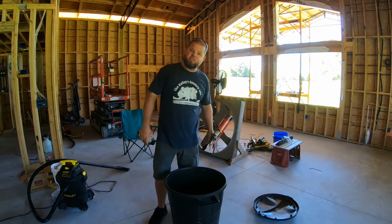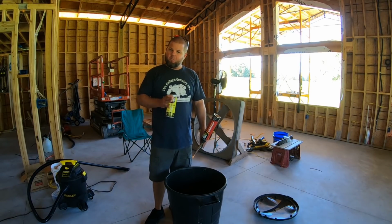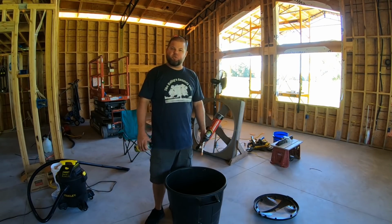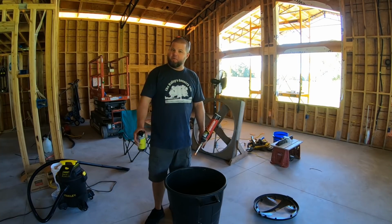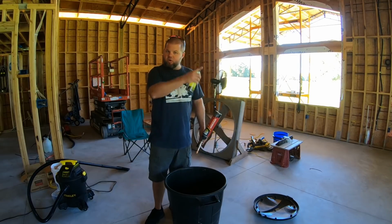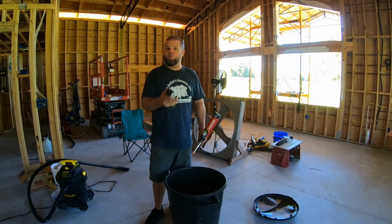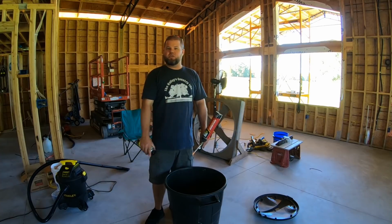All right, so this episode was supposed to have a lot more sealing in it than it did. But, like I said, I was pleasantly surprised to find out from the insulators that they're going to seal bottom plates and everything else that I was going to take the time to do. Not to mention, we're going to seal every crack around the wall, by every 6x6, every double, triple, or quadruple stack stud that can allow air through. Those are supposed to get caulked and sealed as well.